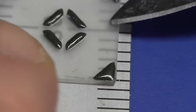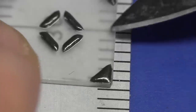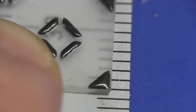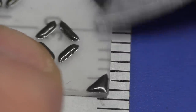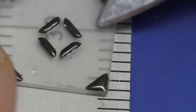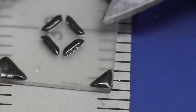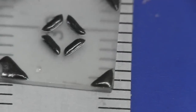This thing is effectively a high-fidelity transmission line, so to speak. Because we're not just passing digital ones and zeros through this thing where signal integrity matters — we're passing analog, high-bandwidth analog information: color video signals. So we need this to be as good a transmission line as possible, including reflections and bounces. If the top surface wasn't treated in some way, we might have surface effects happening as well as the shear wave going through the body, which would cause different delays — it really wouldn't be a good transmission line at all.